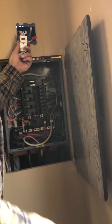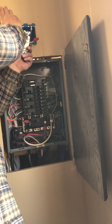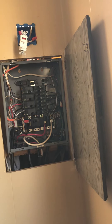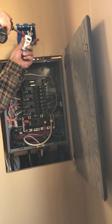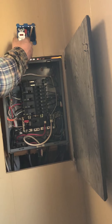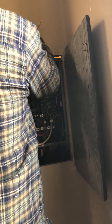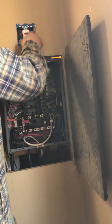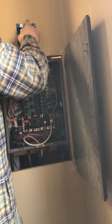Put it over the screw like that, pinch the wire shut, and then run the screw home. That switch is now wired. Tuck my wire nuts back — got my black to my common, got my black to my switched. Both wires are coming off the back, one has been stubbed down through the access port of the trailer floor, and then run the wire.